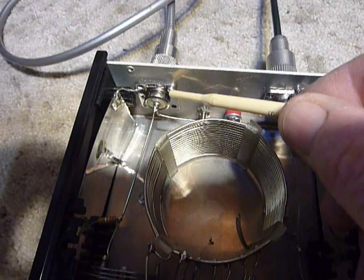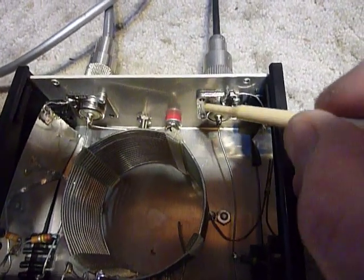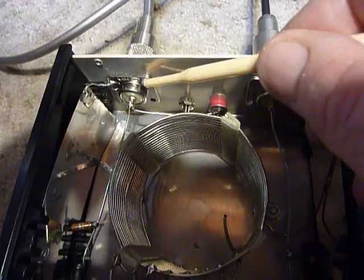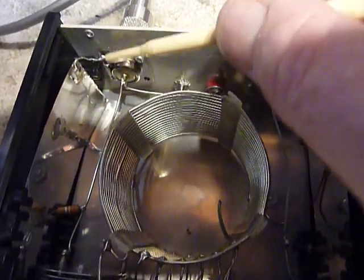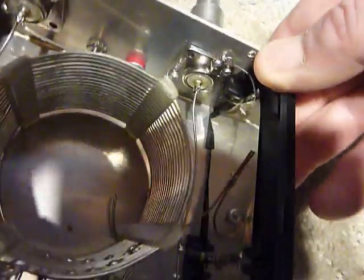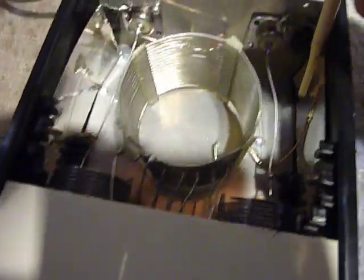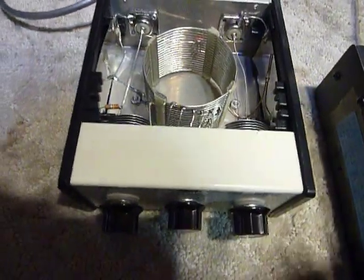The reason this mod is needed: if you look carefully, the coax connectors are put in with pop rivets. I just don't think pop rivets make good electrical connections — they can get loose. So I decided to put these little ground jumpers from the coax connector to this ground plate, which is like a piece of tin can. There's one on the other side too, so I put a one-inch jumper from each of these to a good solid ground so that the coax connectors are grounded properly.